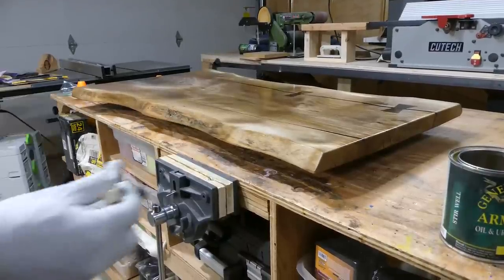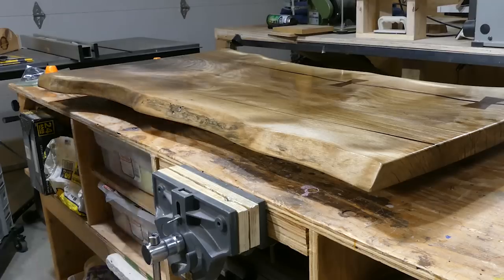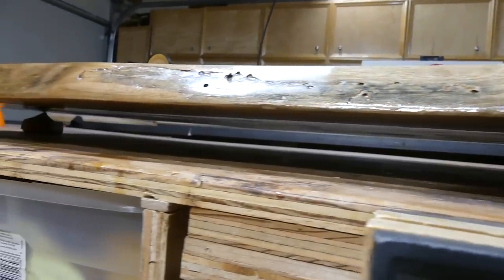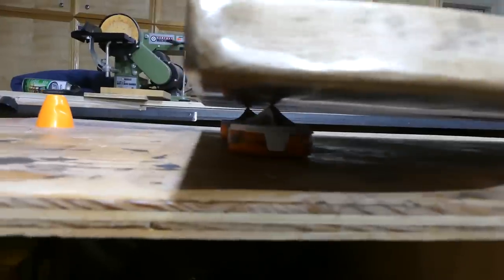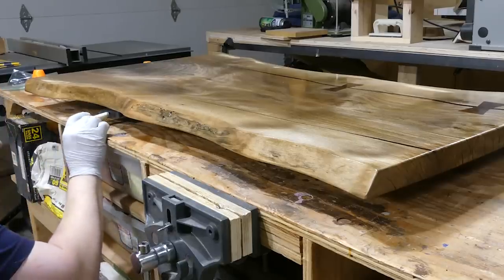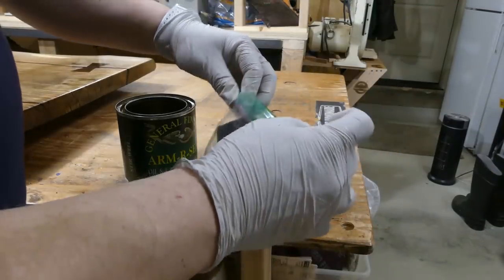My brush is about as dry as I can make it and I'm going to do my cutback with strokes as long as I can — in this case the whole surface. My last step before I leave it alone is to go along, look down under the edges, and see if there are any drips forming. I'll just dab those up as if it were another cutback. I'll keep using the same brush until the project is finished — just squish some of the air out of the bag and keep it in the refrigerator.